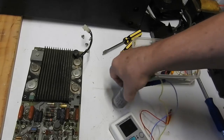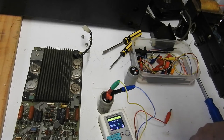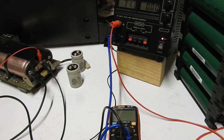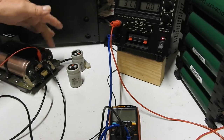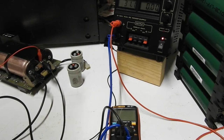This one should come out at 3,000 microfarads. The tester says 3,573 microfarads. That's pretty close to 3,000, but it's a bit high, which often means it's a bad capacitor. I did a whole lot of recording of capacitor testing but it was starting to waffle on a bit too long, so I've discarded that and I'll just give you a summary. I'm trying to test these four large electrolytic capacitors. I first tested them with one of these little multitesters and they all read a bit higher than their specified value, but within tolerance, so they appeared to be okay. But the real test is whether or not they can hold a charge.